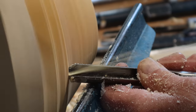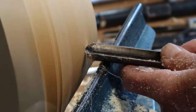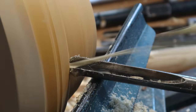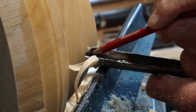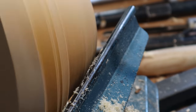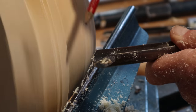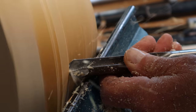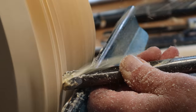I've got several options with this tool. If I want to take a very heavy cut I'm going to be working just below the nose of the tool — you can see it's coming off this portion of the edge. We can also do what we call a back cut. Because the bevel is fairly steep on the side of the tool, you can have the flute almost upright and the shaving is coming off the inside edge.